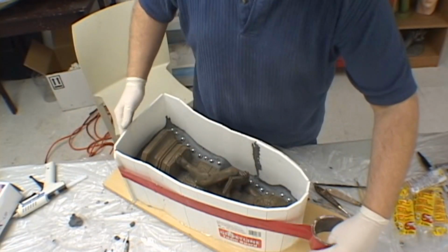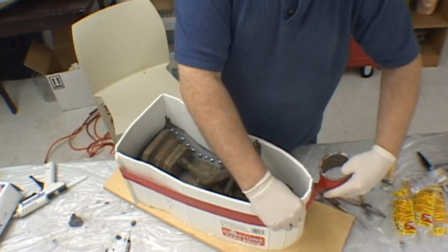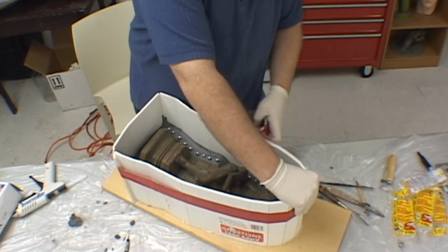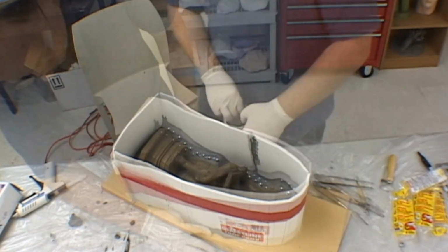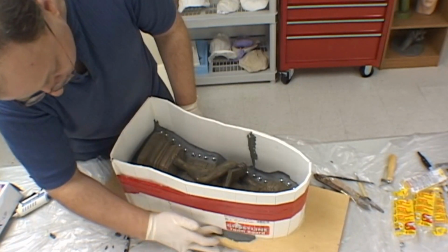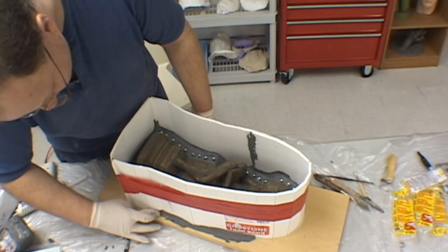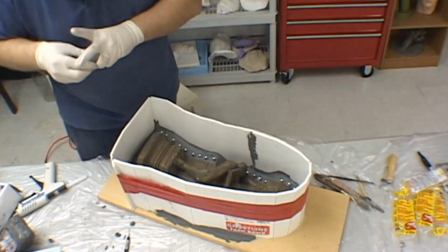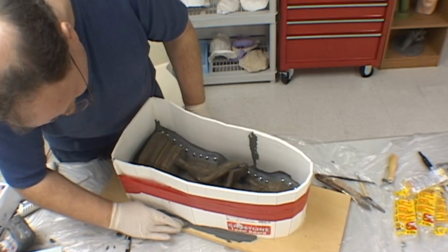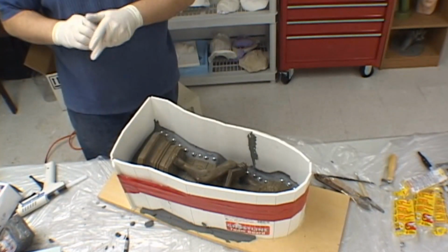After we have sealed the foam board with our glue gun, it is necessary to take additional steps to make sure that there is no leakage. Using duct tape, modeling clay, and basically anything that you might have available around to seal the mold walls and seal the foam board down, do everything you can and take all the time necessary to make sure that you have no leaks. It's better to take extra time and overdo it than to underdo it.